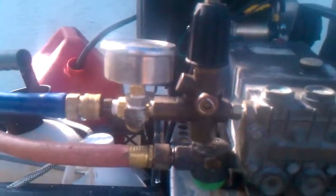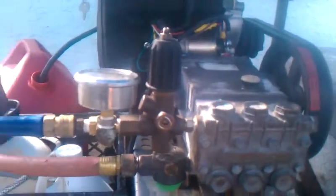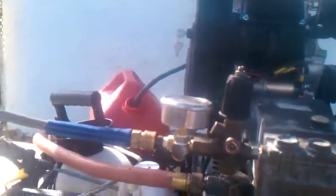this is it. This is the new baby. I put the filter on there, the inlet filter that I've had sitting in my toolbox for about 4 years. That's a 4-year-old brand new inlet filter. I got the Pulsar 2 unloader that John from John's Custom Machines let me take with me yesterday so we could see if the unloader was a problem. I really don't think that my unloader was, but this one's nice and new and shiny looking and adjustable and working well.